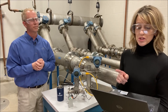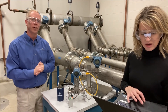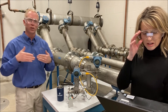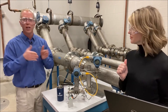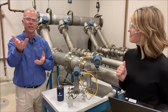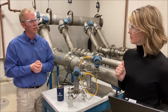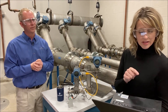Question: what happens if the connection is lost between the HART pressure monitor and the 8800 MV? The 8800 keeps track of when updates come in with a timer between each message, so if you lose communications you'll have a timeout window — just like a control system would. You can configure that setting in the 8800 itself: how long before it goes into an alarm. So you have options for how you want to manage the alarm in the case where you lose communications.